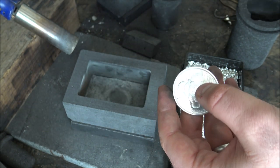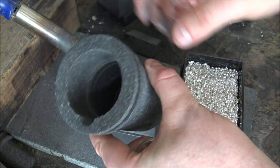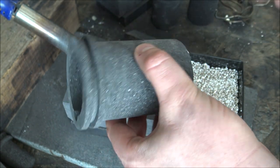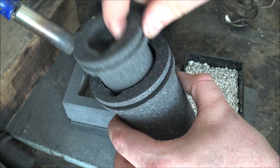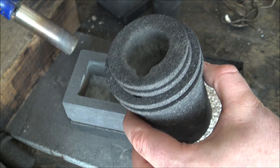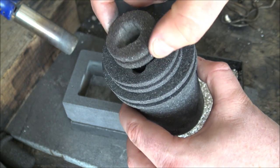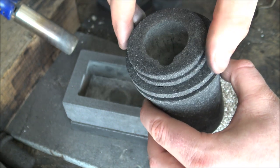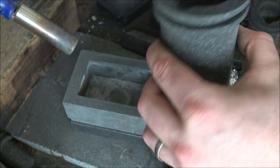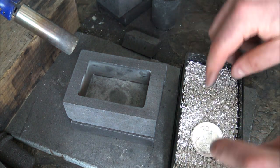The Leopard is going to be dropped into the molten silver contained within the graphite crucible. To put things into size perspective, here is the regular size graphite crucible that I'd normally use — it has a capacity of about 13 to 14 ounces. Then there's the small one, which is what I got started with and holds maybe two and a half to three ounces — it's like a Russian doll with them all stacked up. The coins fit in quite nicely, so we don't need to chop them up. The really good thing about using shot is that you can measure out exact amounts — if you wanted to make a 10.43 ounce bar, you simply put 10.43 ounces in.